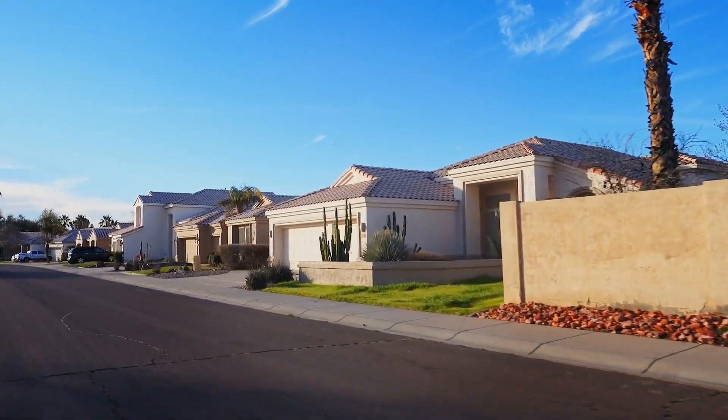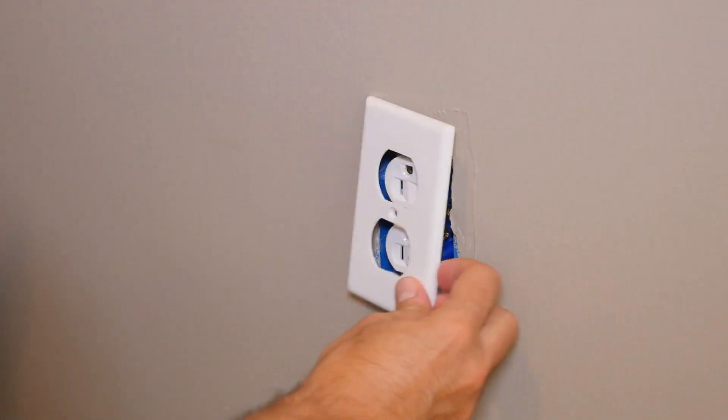You don't actually have to have UV-protected cable if you have a box — all the cables are going to come together inside. Where should they come together? I've seen them in garages, and that's okay. But if you're in Texas or Arizona, garages can get pretty high in temperature — you don't want to put your routers and switches in the garage when it's 120 degrees. The best place is in the master bedroom closet, and you should put it close to a 110V outlet.